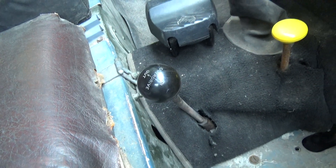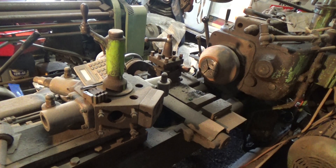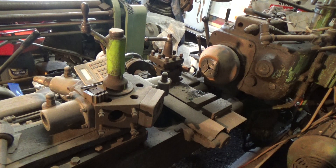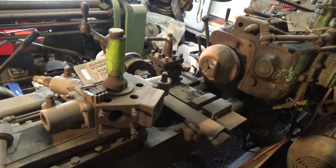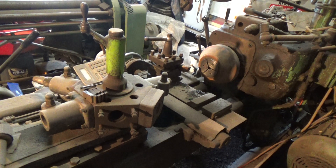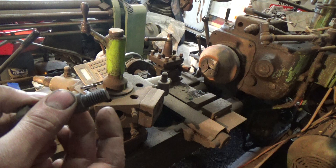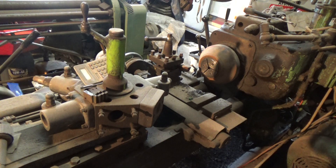So today's video is going to be about that. As you can see, this thing's starting to get a bit of a mess now, but it's been in here for four years this winter. It doesn't get used all that often — probably gets used three times a year if that — but a very handy thing to have when you do need it. I've neglected to take the tapers out of the turret there, so they've rusted up solid as well. This is our pin — what we need to do is measure the diameter, which is about 17mm — so I'm going to find a collet to put in the collet chuck to suit this pin.